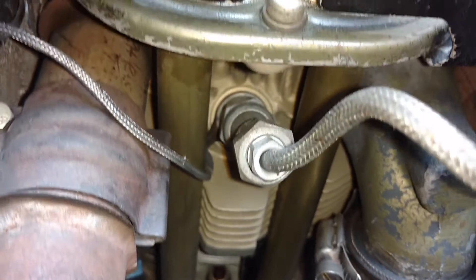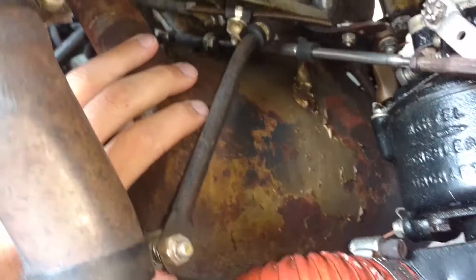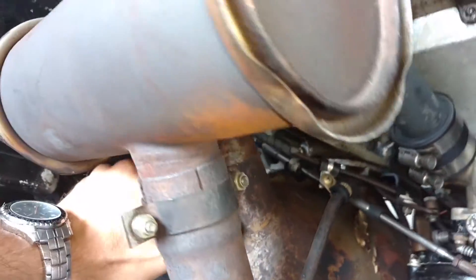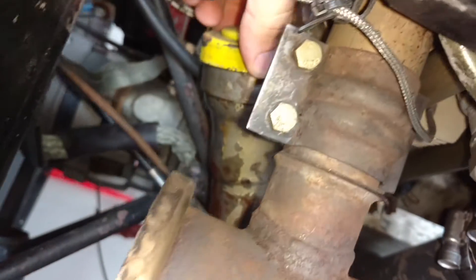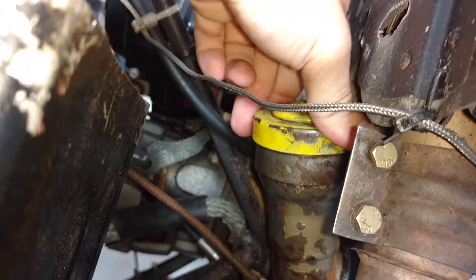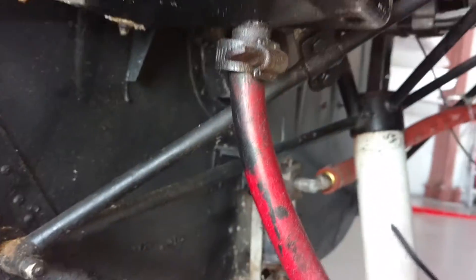But it's always nice to have an idea of what your hottest cylinder is running. Moving on down, you have your oil pan underneath the engine — that's where all the oil sits, the oil sump. You see the filler neck, and that little yellow cap is where you would fill your engine with oil. The oil basically sits right down at the bottom of that sump. You can open up that cap, check the oil level on the dipstick — much like you would on your car — and it'll have little lines with numbers to indicate how much oil is actually in the sump.